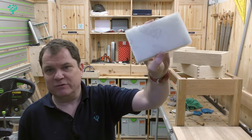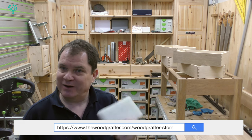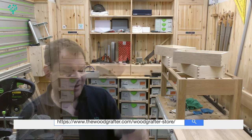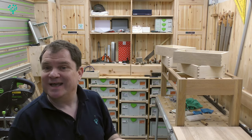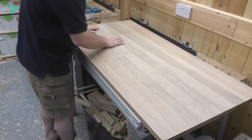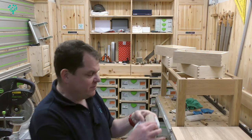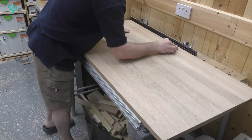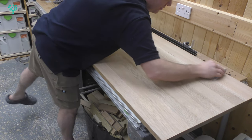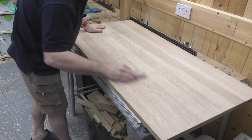Whether applying the tint or the final coat, the approach is exactly the same. I use these white 3M sponges — there's a link on my affiliate site over on the website. I just cut these into usable squares. The quality of your finish is directly related to the quality of your preparation. We've already flattened this down in a previous episode. Now I've just gone through and taken out any bits of dirt I don't like — as simple as coming through with some 180 grit sandpaper wrapped around an offcut of oak and lightly rubbing anything on the top I'm not happy with. I tend to go over the entire top like this by hand. When you're using a power tool you tend to gloss over small problem areas, but doing it by hand you focus much more and I find that gives me that neat finish.